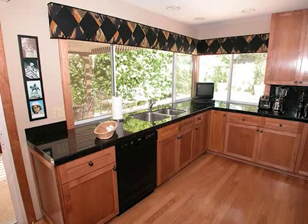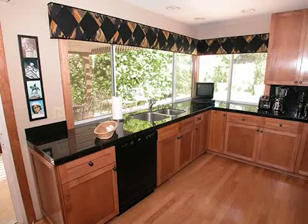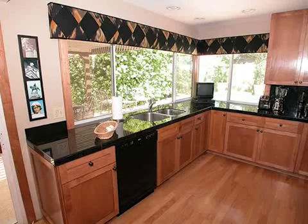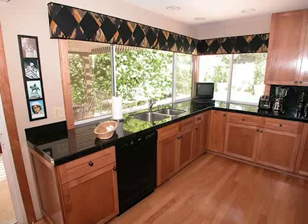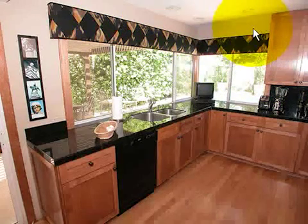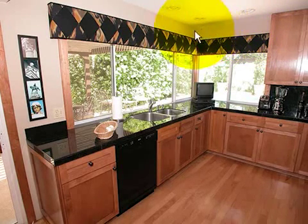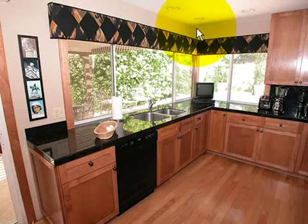I was asked the question, well, if it wasn't done right, what would we see? And what you would see would be the windows beginning to tighten or seeming to not seat properly as you close them. You might see sheetrock cracks up here in the header, and ultimately you would have a broken window. But again, this can be done properly, and it's certainly a wonderful effect.